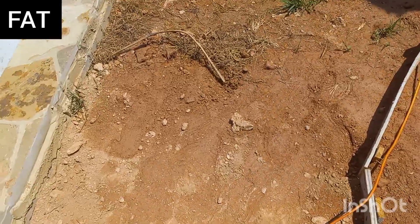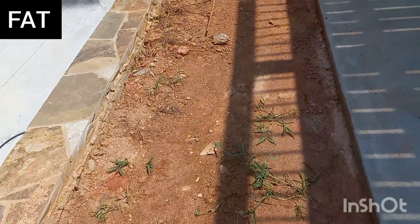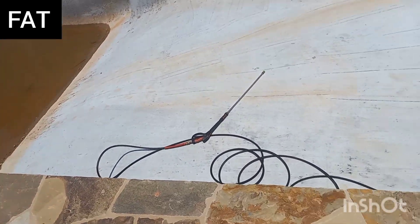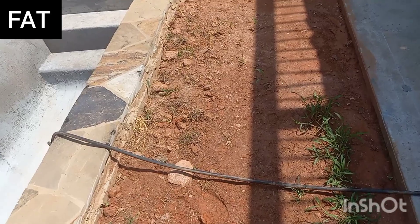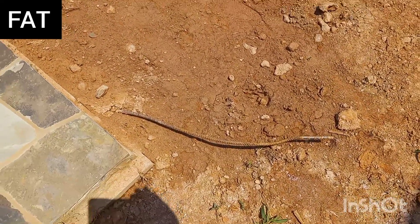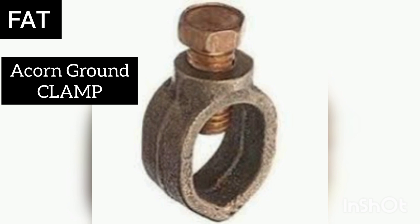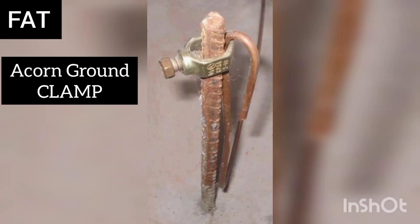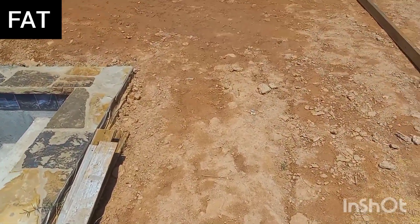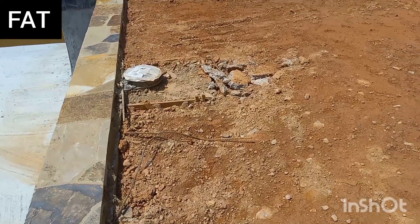You're going to want to attach to as many of these rebars coming out the side as you can. If you can't find them, you're going to have to dig for them — they're all in the side of your pool. If it hasn't been shotcrete'd yet, you can see where they're at and attach them pretty simply. You're going to attach the rebars with an acorn clamp — I'll show you what an acorn clamp is in a second. You bring it right along around through here and attach to as many places as you can, usually anywhere from 6 to 15 spots depending on the size of the pool.